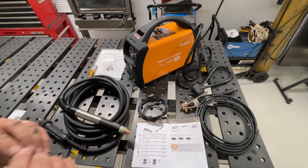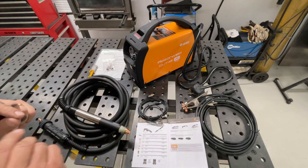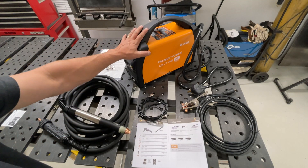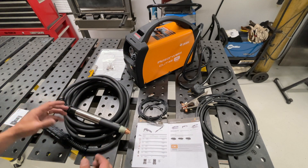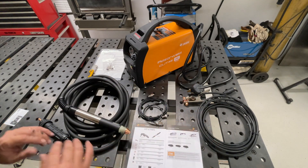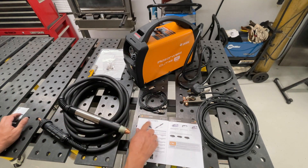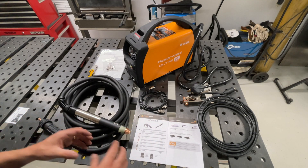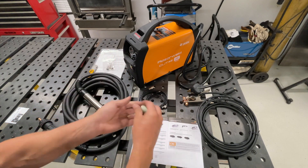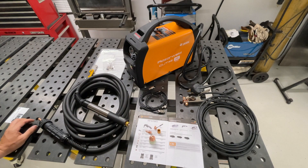I spoke to the company and one of the problems we had with the Crossfire Pro a long time ago was the Razorweld misfiring. They found out we had to change a resistor inside, sent out a bulletin with the fix, and it worked perfectly afterwards. All those problems are fixed in this new machine being sent out with the Crossfire XR and also with the Crossfire Pros now. Something really cool: the consumables for this new machine torch are just like on the Crossfire Pro — they are the Hypertherm 45 parts. The nozzle, electrode, swirl cup — all easily replaceable and you can find them on eBay.